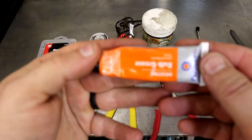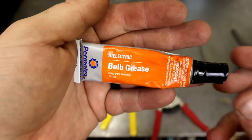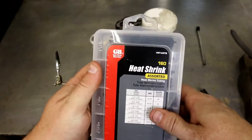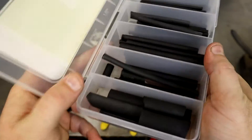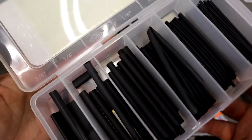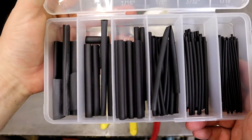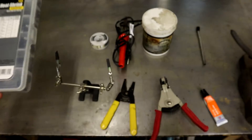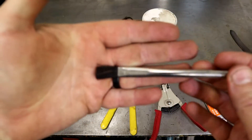Also, when we get done soldering and before we put our heat shrink on, I like to use dielectric grease over the solder joint — it makes it waterproof and non-corrosive for years to come. Here's a box of heat shrink — you can get them in bags but these come in all different sizes and lengths. This one goes from 1/16th up to 3/8 inch diameter, probably three inches long. I'll link different ones in the description so you've got a good choice on price range. Also, here are the acid brushes — these cheap little brushes are what I use to apply the flux.